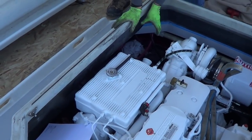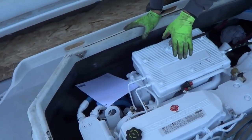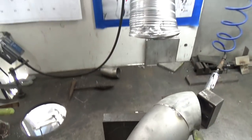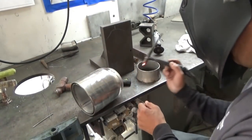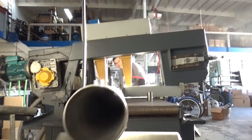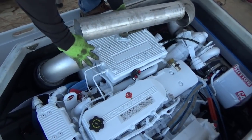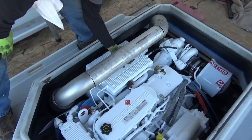Short radius. And we're going to put a 45 so you just clear this, no problem, I think — go like this and like this. Right on the inside, I like right about here. We'll go dry all the way across. So you got your 45 on there? Yeah, I got a short radius — it's not a big 90, so it's not bad using a short radius for this one. It's one of our custom Seaboard mixing bells. I see it's laid in a piece of hose here. We can mount it up and then go over this here — kind of like that. That's about the right height, too.